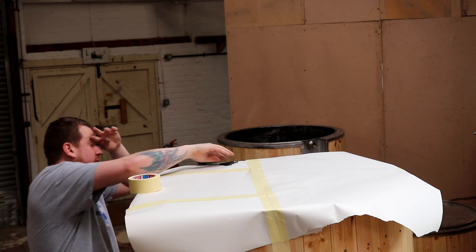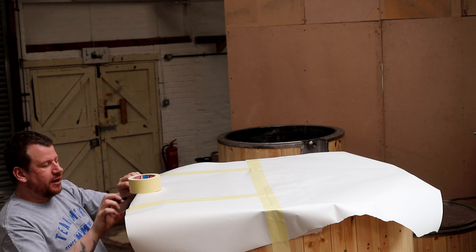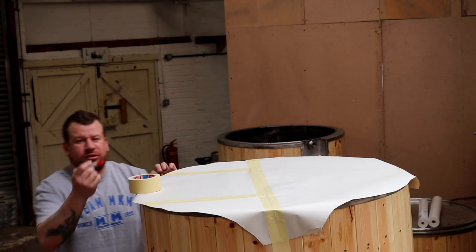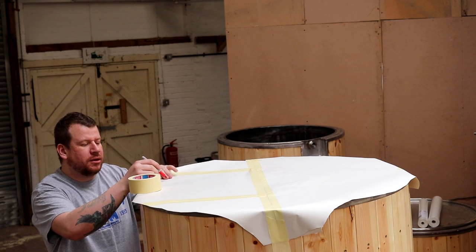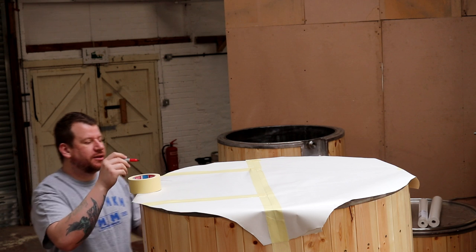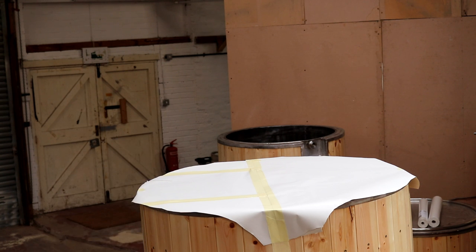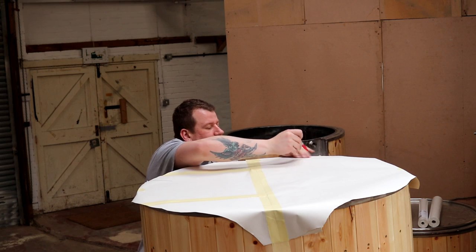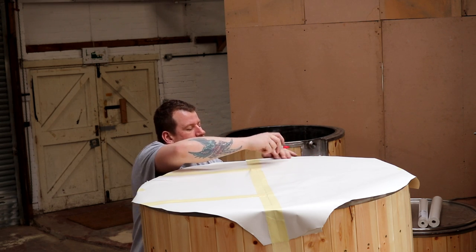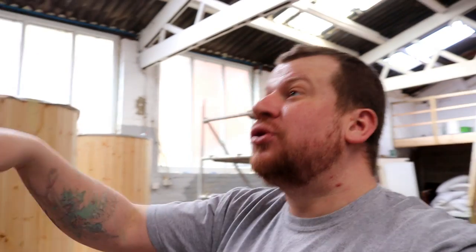There you can see we've now got a rough shape. Now I'll take my trusty red Sharpie, draw a line off the tank and onto the edge of the tank, and then I'm basically just going to go around. Now we'll take it off, back into the shop, cut the paper out nice and neat, stick it onto some steel, draw around it on the steel, and then cut the steel out with the plasma cutter. So I'll have to charge up the compressor.